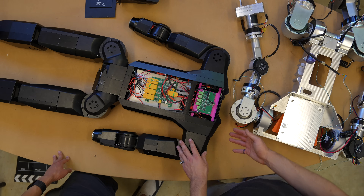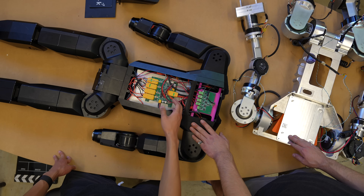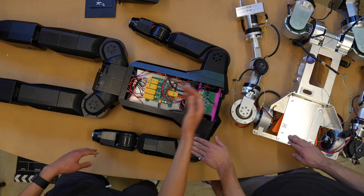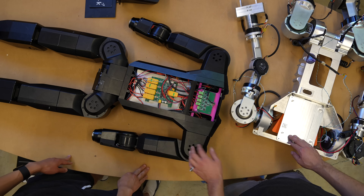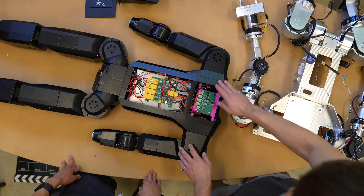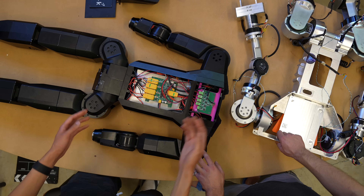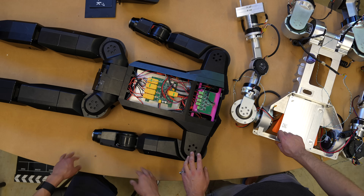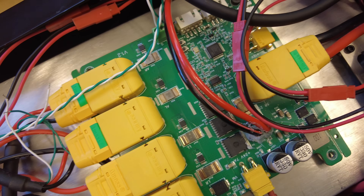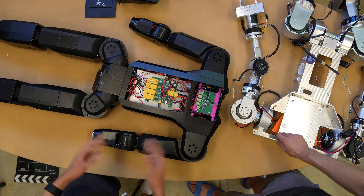Here we have the torso exposed. You can see the two main PCBs: the power board, which is in charge of distributing 48 volts from the battery to each of the four limbs, and both the CAN lines and power lines are daisy-chained from one actuator to the next, so we only have four connections here. We have our CAN board taking in all of the controls from all the different actuators, daisy-chained to each one, with a simple USB interface up to the head. In the next revision, we're combining these boards into a much more compact single PCB on the back of the battery case. We're also improving the e-stop — it will be integrated into the power board with both a wireless and wired solution.